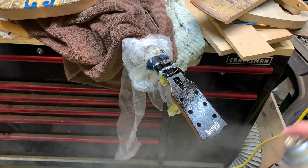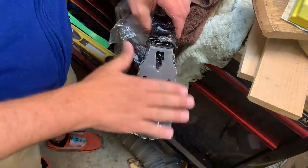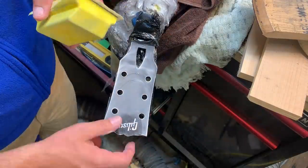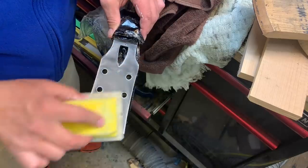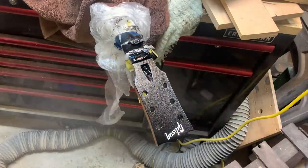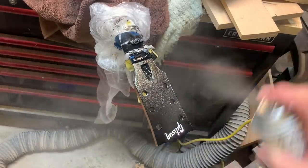We're going to come back with some Stew-Mac nitro gloss and get that cleaned up, sanded a bunch of times, so it gets a nice smooth surface. These are Silics sanding sheets — you can see a little bit of where that filler is up on the upper left side, and as I added more progressive coats I got that evened off.